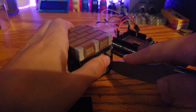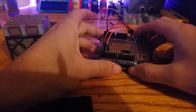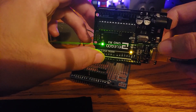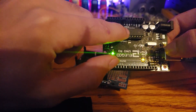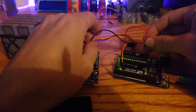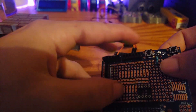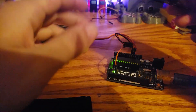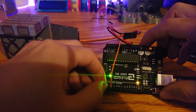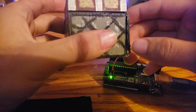I'm going to use a knife and break some spots that I melted together to show what's inside. Here is the microcontroller I'm using — this is an Elegoo Uno board with the Atmega 328P. All I have hooked up is the servo's data line on pin three, power to five volts, and ground. I also have a button hooked up with a resistor to pin number two on the board.